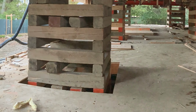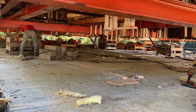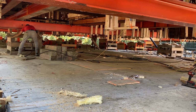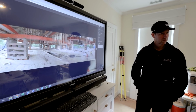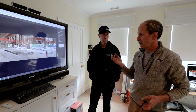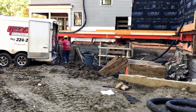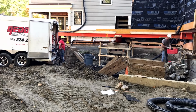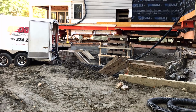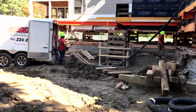So one of the things that having the deck in is it facilitates the guys moving around, because as the building went up, they were walking on this deck. They had pre-stacked the cribbing that they would need near each pile of cribs, so it facilitated the process going up. Every time it went up, they threw in 4 more pieces of cribbing, reset the jacks, and having the existing deck on the floor allowed them to do that. But since we were replacing the deck, we left it behind, so we lifted the building from above the existing deck. Makes sense. So an easier work platform.